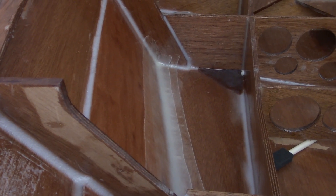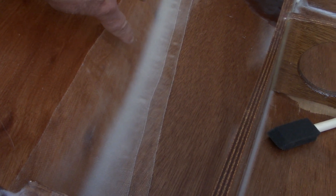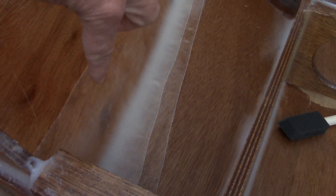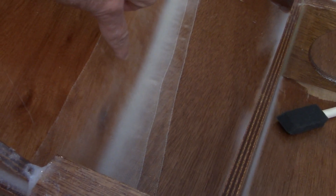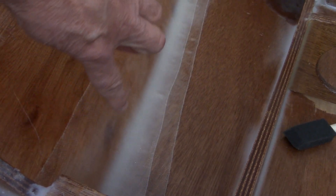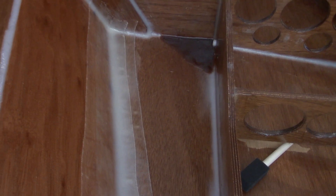So that is what I have been talking about right here. The reason I trimmed the edge off of that first piece was so I wouldn't have that high spot underneath that second piece. As I've explained in the past, if I don't trim that edge, I've got that little piece of fiberglass woven into the edge of the tape — and if I don't trim that off, I'm going to end up with a bump and a high spot all along that little strip of glass right there, and that can create air bubbles. So it's just easier to go ahead and trim that off before I lay a second piece on.